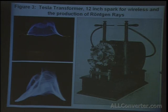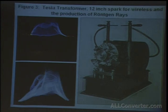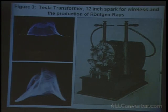And the way this works is the current is flowing through this interrupter. By adjusting the tension of it, you can adjust how quickly the condensers charge and discharge through the coil. And the most powerful effects are produced when the little steel armature on the bottom of that copper piece is almost touching the coil. And if you separate it just slightly, it'll vibrate very, very quickly. And the most current's made to flow through the system that way, because the circuit's closed for the most amount of time. To the left, you see the coil.